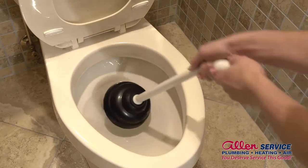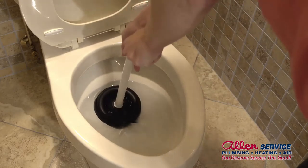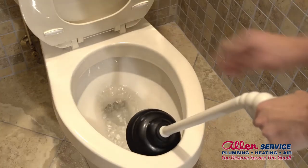If there's too much water in the toilet and it's going to splash and slosh, you want to bail a little bit out. Tip the plunger so that the cup fills with water. Position it vertically over the drain and then gently push down and then pull up fast.